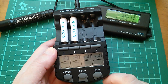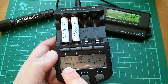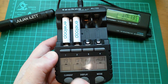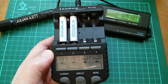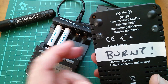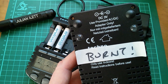So there it is — there's my one remaining Technoline BL700 charging these two cells. It's actually picked up that other cell now so it's now charging both of them. I think what happens is that the one that charges gets warm, transfers a bit of heat into the other one, then its voltage comes up, this sees that voltage and starts charging. And here's my burnt-out Technoline BL700 — entirely my fault of course. I put 12 volts in where it can only take 3 volts, but this 3-volt thing is a bit annoying, isn't it? Cheerio.